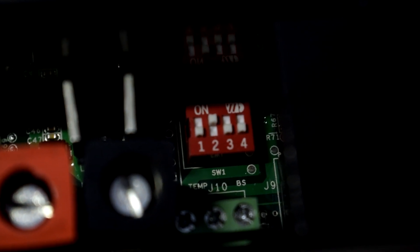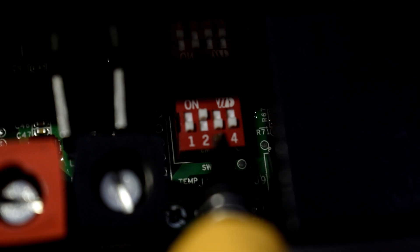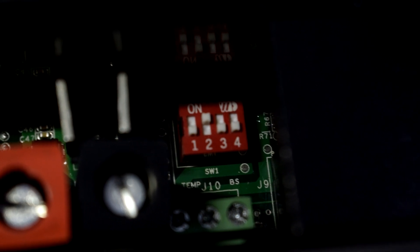The next switch is for selecting your battery bank voltage, either 12 or 24 volts. If this switch is in the on position, the solar charge controller will work in 24 volt configuration. If it is turned off, it will automatically select 12 or 24 volts depending upon your battery bank.